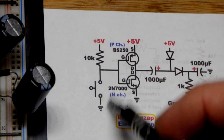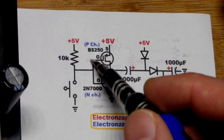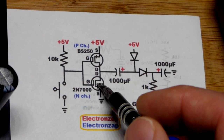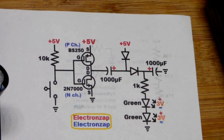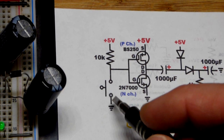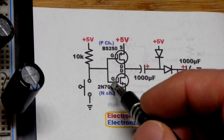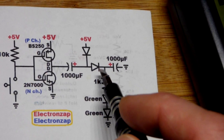Now we look at the schematic part of this switch. We have the positive supply coming through that resistor to the gates, because no current is flowing we get 5 volts to the gate. When the gate's positive, the channels are made more negative, which turns on the N-channel but turns off the P-channel, giving us the path to charge the capacitor. To give a low input — and again, integrated circuits or oscillators would be much better — you close the switch, giving a direct connection to ground. That's what we need the resistor for, so current can flow that way. We put zero volts to the gates, which turns off the N-channel and turns on the P-channel, pumping current into the output capacitor and through the load.